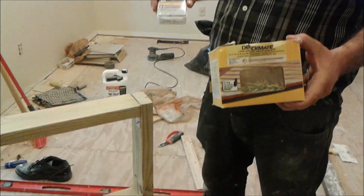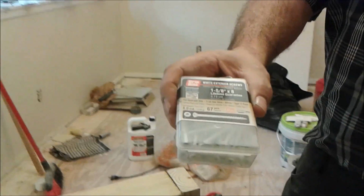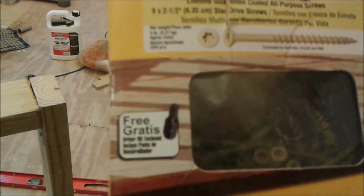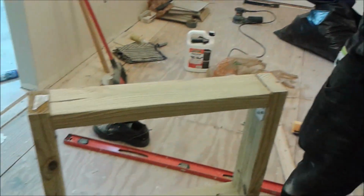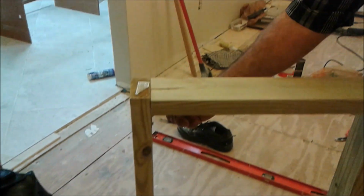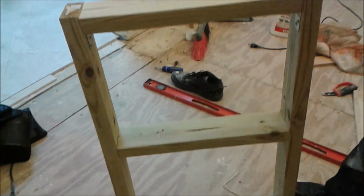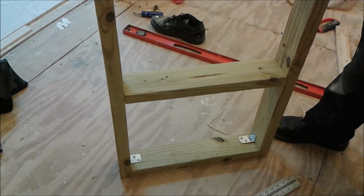The screws that I use, all of them, are for untreated wood. One is 1 5/8, and the other one is, how much is it? 2 1/4. Okay, so with that one I built, using it at 90 degrees to put it here, this kind of rectangular frame, and I'm going to put it on the bottom of the cabinet.